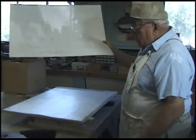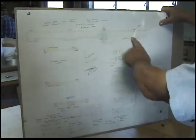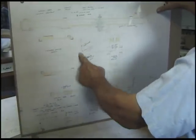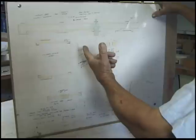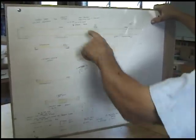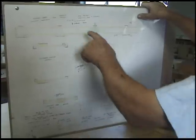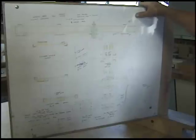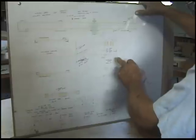That forms it. So that's for the crankcase, and then here are the water jacket, I mean the water manifold, and then there's the water jacket layout. And this is all laid out very accurately with the shrinkage allowed in there. We use a 1/8-inch shrink rule, meaning that we used a rule that's been divided up. It's 1/8 inch longer per foot than a normal rule. So there's the water jacket layout, and here's the water pump, the two halves of the water pump.